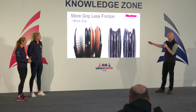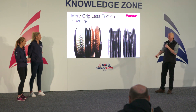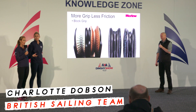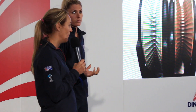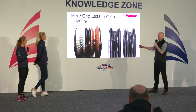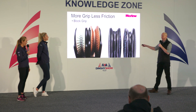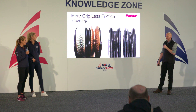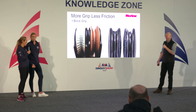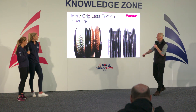We're seeing a lot of those ratchet blocks on the Nacra and through all of the Olympic classes — Fireballs, pretty much across the board. We use the slightly softer blocks with a grippy rope so that in light winds you have quite a lot of feel — you can feel every little gust and lull when there's not a lot of sheet tension. But by marrying that up with the really grippy rope, when it gets windy and there's a lot of load in the sheet, it's not going to blow Saskia's grip strength up really quickly. Pretty much everybody in the top fleets has moved to one of these options.